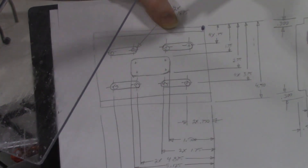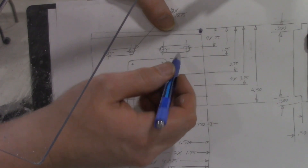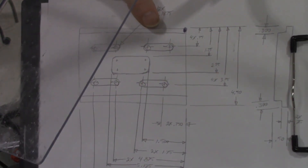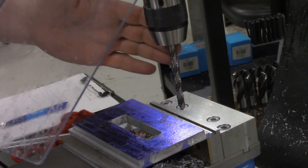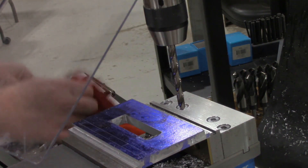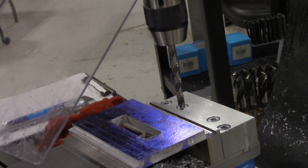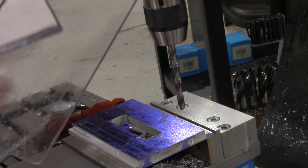We're doing it with a smaller drill bit, then we'll clean them up with an end mill and knock out the rest of the material forming the slot. I've already got the drill bit ready, the part has been set up, we found its edges. This is all continuation of the setup that we've had before. We're just going to go ahead and knock out those drill locations.